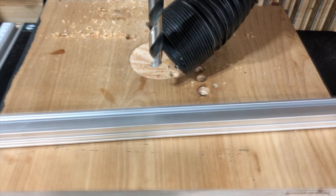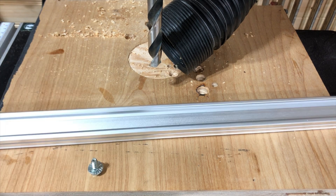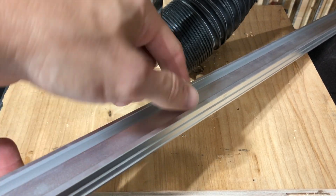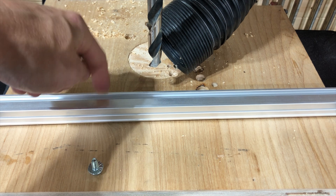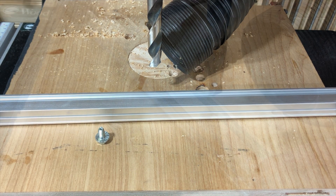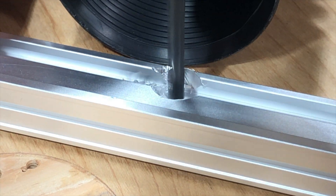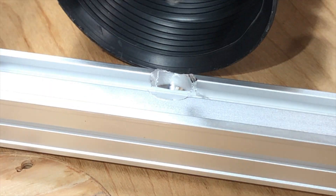So next, because it's a custom install, we have to drill a hole that is big enough for these pan head screws to fit inside. If you look, there are a number of grooves — we are drilling one that looks like the dovetail here. I'm just going to space them two on each one because we have a total of four. And we'll poke a hole with the drill bit they supplied to run these through and into the table. So here is the part where I start drilling — this is a really weird drill bit, it's a 35-64. It fit exactly for those pan head screws. Now this bit here is supplied in the kit and is exactly meant to thread those machine head screws.